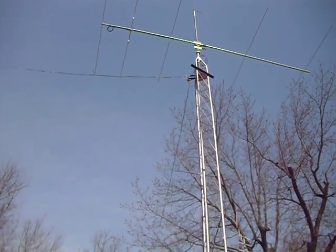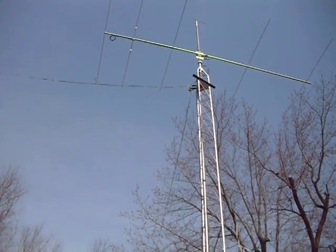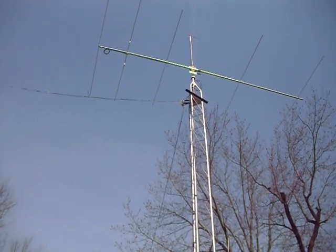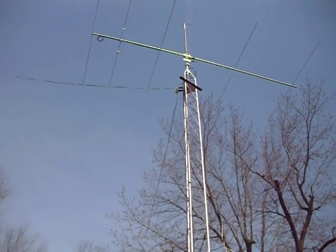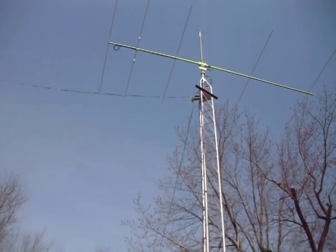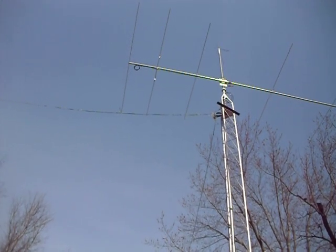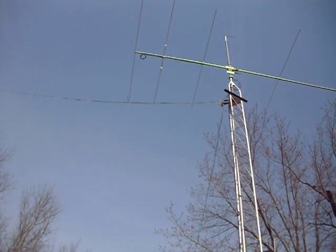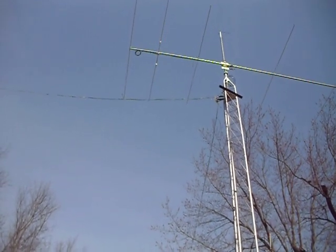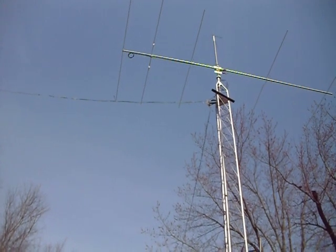This is the best performing antenna I have had here at this location — I've been here 45 years now — and it does a super nice job. It will also work on all the other bands using the SA-2060A Heathkit antenna tuner, and of course you could use any tuner. I also wanted to mention that it will work on 160 meters — it's not the best antenna on 160, but I've made a lot of contacts on 160 with it, so it does a halfway decent job. It is far superior on 80, especially with the low noise floor. 73s and good DX.